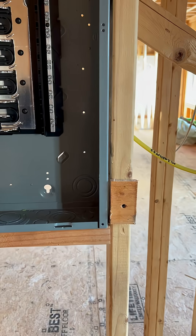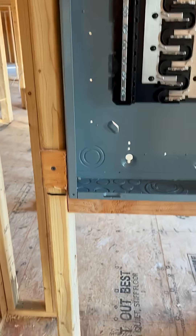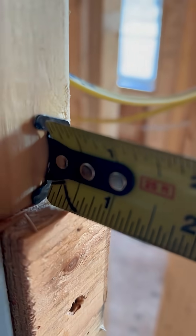I've seen so many guys complain about these home line panels — all the sides are warped when they're installing them flush mount, and the reason for that is you're not measuring to the bottom of the studs and you're not getting your proper spacing.